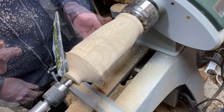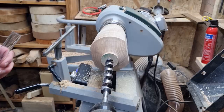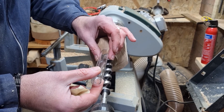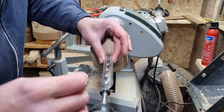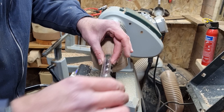I think the shape's pretty much there, pretty happy the way it is. Next step now is to drill out our hole for our tube. I've got a nice long auger bit here, 20 millimetres wide, the same as my tube. Now I want to go in obviously the depth of the tube but I want to go a little bit further than that, just to make sure it's below the surface so I can curve out the edges a little bit. So I'm just going to put a bit of tape on the shaft so I know when to stop. Let's make a hole.